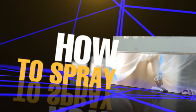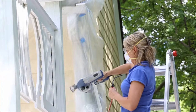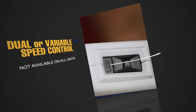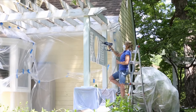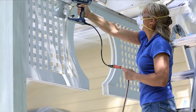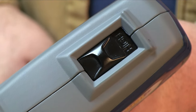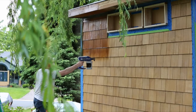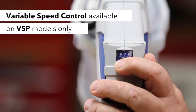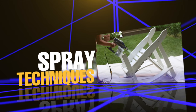With the TrueCoat 360 sprayer, you won't need to worry about the spraying angle — you can spray in any direction, 360 degrees. Here are some tips to ensure you achieve the best results. The dual or variable speed control feature lets you manage how fast or slow the material leaves the sprayer. The low setting delivers more control and reduces overspray — use this setting when first learning to spray or when spraying small items that require more control. Turn the speed control to high when you want to get the job done fast or when spraying large surfaces.